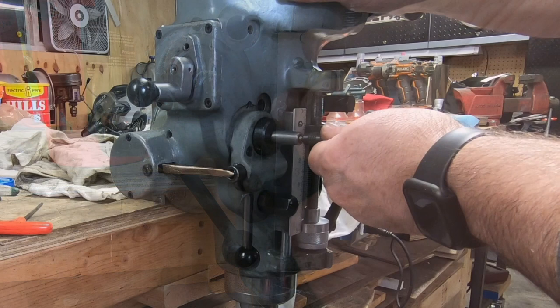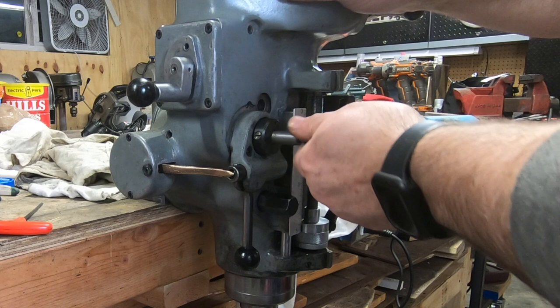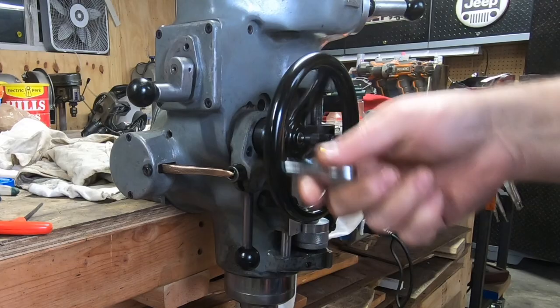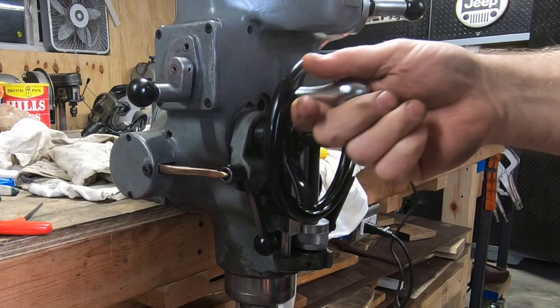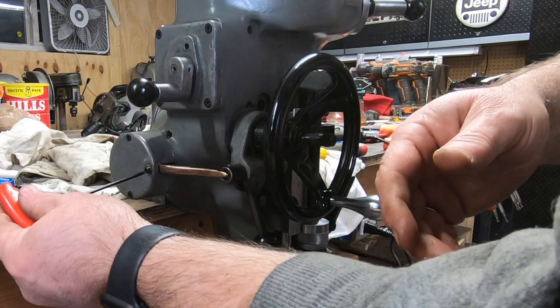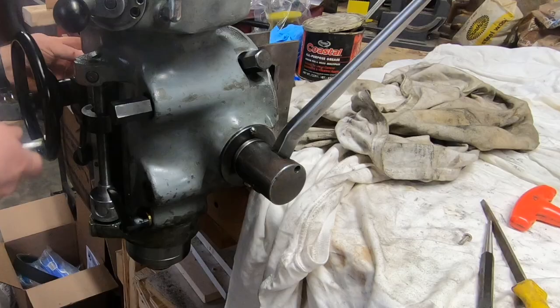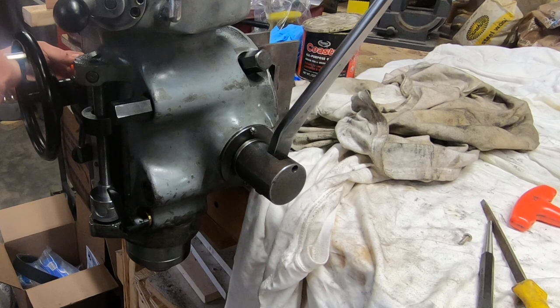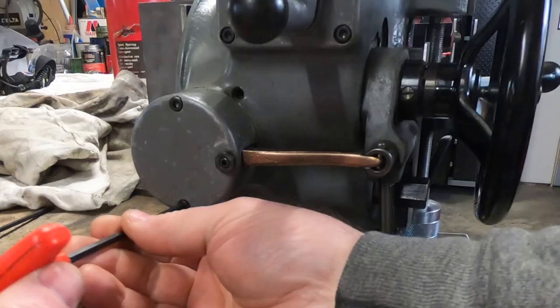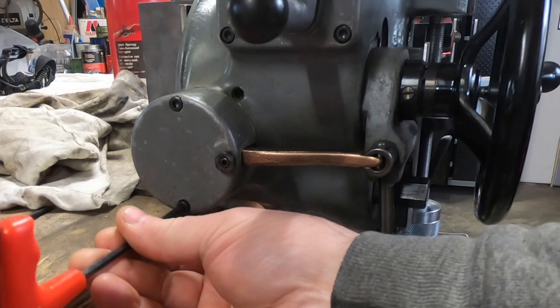At this point I wanted to do a little testing just to make sure things were working the way they're supposed to, so I'm doing some manual testing of the power feed — engaging the gears at the top of the quill housing in that cradle manually with my hand. I don't think the clutch is engaging with the pinion shaft, so I'm forcing it here. This is not a permanent fix, it's just more of a diagnostic measure. But when I force it you can see how the hand wheel now causes the quill handle to move. Rather than replace components, there's actually a very simple fix for this.